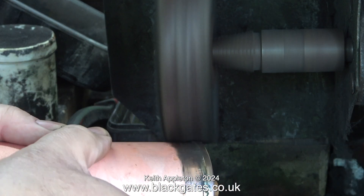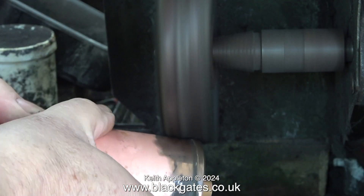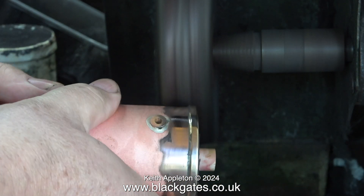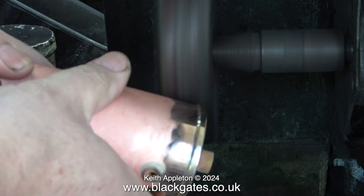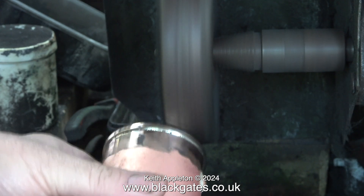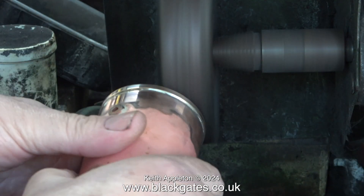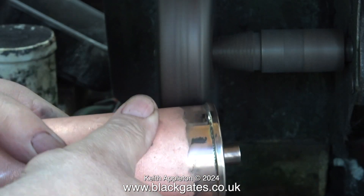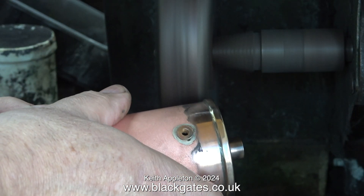The original Bernat Vulcan boiler was made from very thin material and soft soldered. This one is utterly over the top for the working pressure it's going to be running at. By thoroughly cleaning the silver solder joint using this method it shows how homogenous it is. It looks okay but it needs a bit of a cleanup in the lathe — more about that shortly.